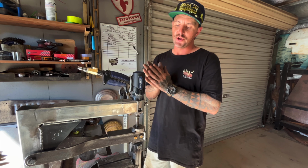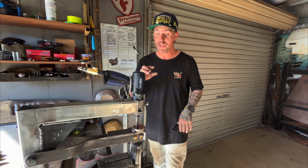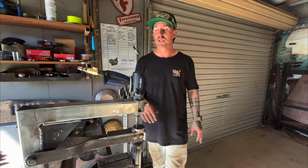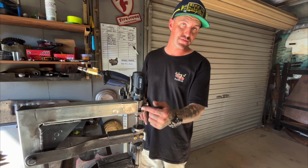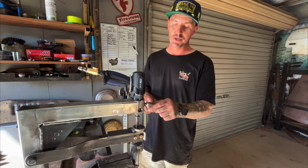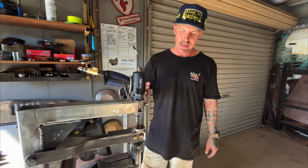Okay, so I've done a little bit of tinkering around with this thing. I've chucked my camera on charge, so you've missed out a little bit. Not too much. Just me smashing this thing up. First of all, after undoing this a few times, I did actually strip the thread eventually. So I've welded a nut on the outside, just tacked it on. That's given me a little bit of thread to work with to keep this here nice and strong.